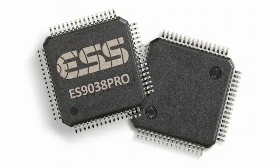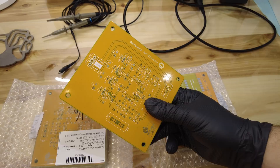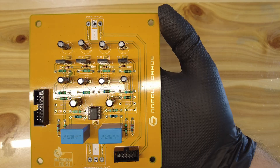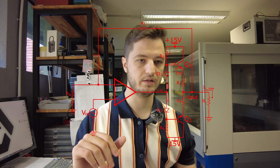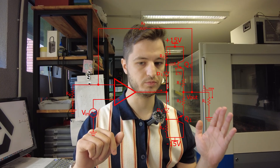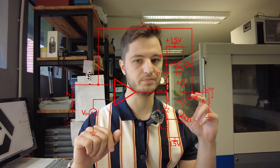There are a couple of ways we can tackle the problem of making an amplifier. One option would be to use a fully integrated solution — an IC that has everything contained in it. Another solution would be to go discrete, basically using components like transistors to build our own amp. We picked a specific topology where we're going to use an operational amplifier and then an additional push-pull output with two complementary pair transistors.